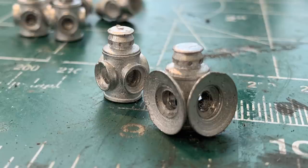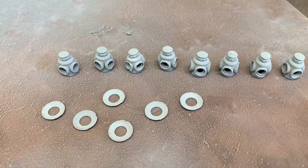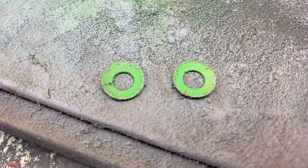It also requires cleaning up the inside of the day target — carefully sizing it so it easily slips onto the lens mount for the switch lantern. I cast up enough to do two of my lanterns with the little day targets, but the rest will just have lenses. Over to the paint booth to start getting some primer and color on these. The lanterns themselves are being entirely painted in old Floquil railroad colors — Grimy Black — while the day targets are being painted with acrylic paints, weathered to look a little beat up and pitted with rust.